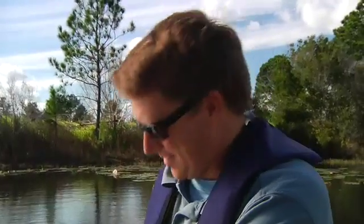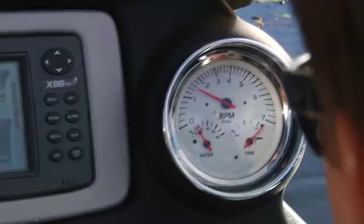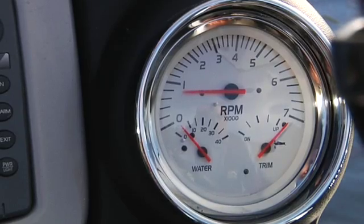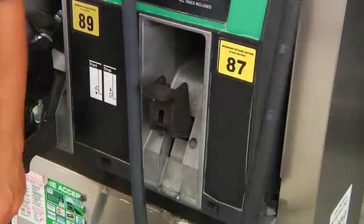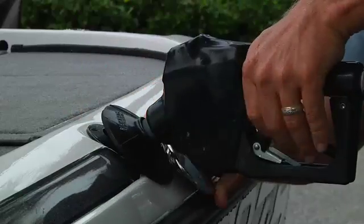Alright, skipper — good job. As the pilots say, make sure everything is in the green, meaning check your gauges for the proper operating range. The amp meter or volt meter should show a positive charge. The water temperature gauge, if you have one, should be in the suggested operating range. Check the fuel gauge — we took care of this on the way to the ramp, but it never hurts to double check. Make sure you have plenty of fuel for the activities you have planned.